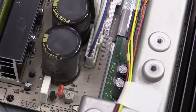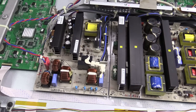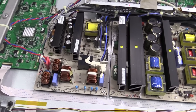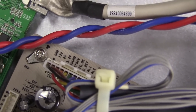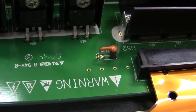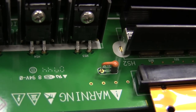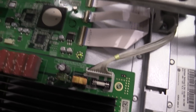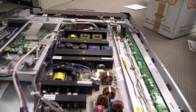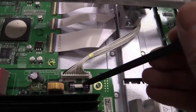In a plasma TV, VS and VA are the two things you want to check first if anything's wrong. Then we've got this smaller power supply module — significantly smaller heat sink — which handles all the low voltage stuff: 5 volt, 3.3 volt and so on for the digital logic side. There's a tiny interesting axial-type fuse in here. The horizontal board has a socketed fuse, and there are a few more on the main power supply — occasionally a fault could just be a blown fuse. These are HRC fuses, not glass fuse rubbish.